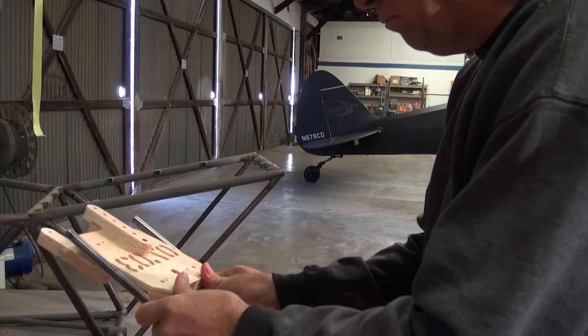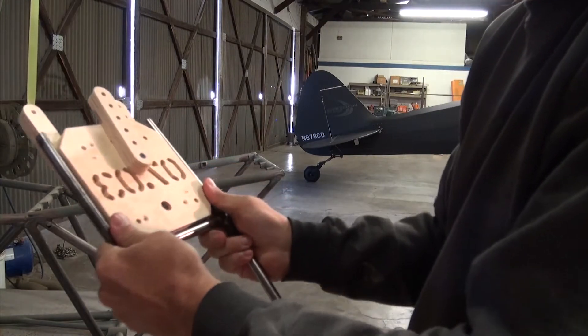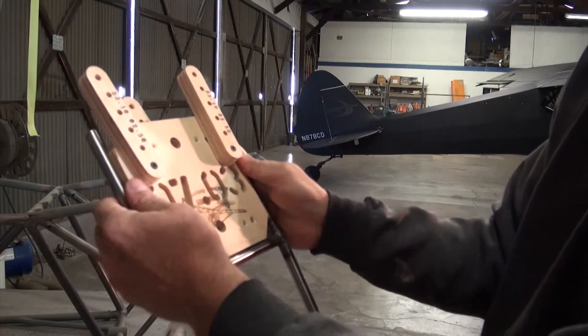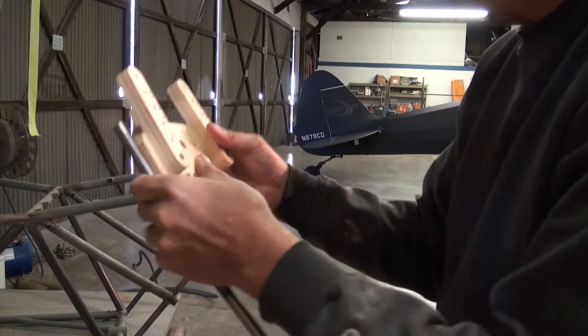We'll attach a couple of blocks to one side and one on the other side, as shown here. The lower tube should fit fairly snugly because of the contraction from the welding. Ensure that the tubes are centered on the wooden fixture and that the fixture is tight and snug up against the crossbar.